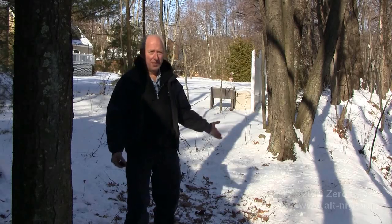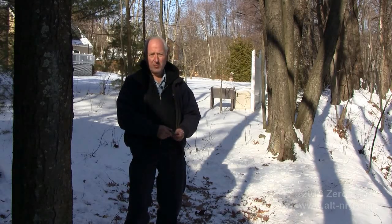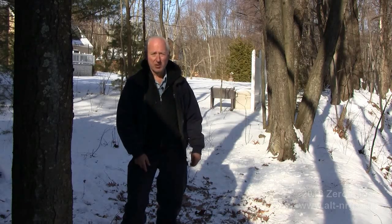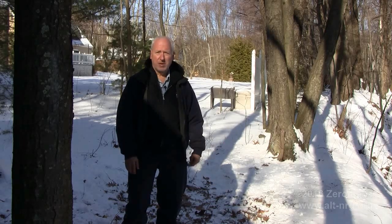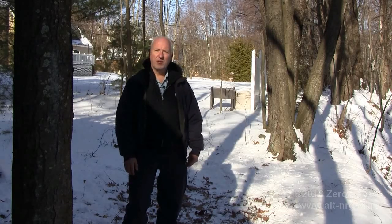Okay, so you'll notice that the tank is no longer behind me. After peeling off the skin and prying away a little bit of the injection insulation — the foam insulation that's injected around the jacket of the water heater — I found quite a bit of evidence of rust underneath the foam insulation. What does that mean? It means the tank was perforated. What have we learned from this lesson? Electric water heaters are not such a good candidate for rocket stoves, because if you don't get all of the leaks, you're going to have carbon monoxide or worse leaking into your living space, and that's not a good thing. So we've aborted the mission and I'll be looking for a 100-pound propane tank instead.